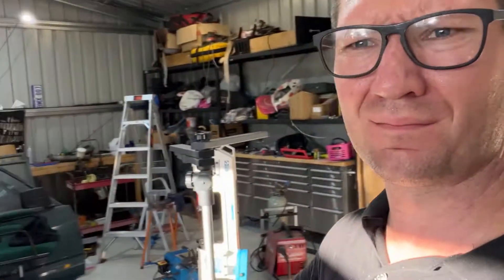That's going to be it for this episode - a good way to get the four-into-one collectors done. If you're using that style of bandsaw, it's really only just up to the job - ideally a bigger one would be nicer. I've seen people do it with just a normal chop or friction saw, but the bandsaw does much cleaner cuts, so I definitely recommend getting one of those. Thanks for watching - I'll see you next time on Sans Project Bench.